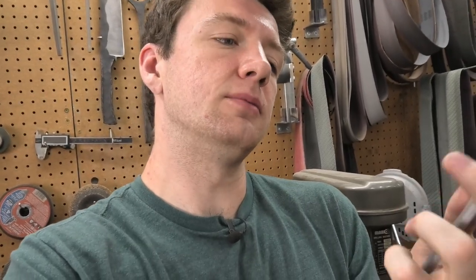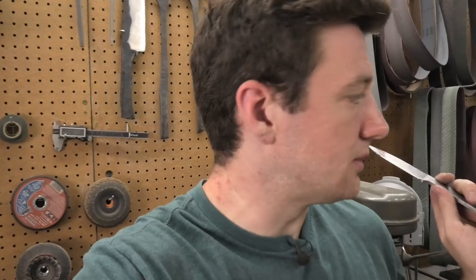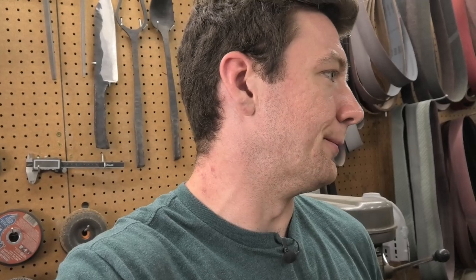It gets very hot and then cools down really quickly. That could make the blade itself warp and bend, and that could make the edge kind of serpentine, like turn into a snake, and that's impossible to fix. So I kind of just have to hope that doesn't happen, because the edge was 23 to 25 thousandths going all the way down, which is too thin normally, but I'll just have to be careful not to overheat it. That would help. And I also probably won't preheat the oil. I want to get full hardness out of it though. I'm just gonna do it normally and we'll see what happens.